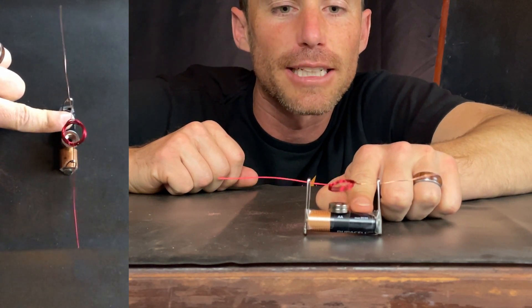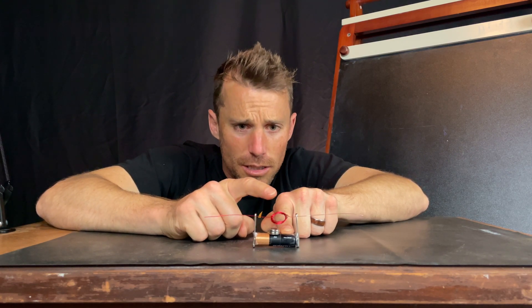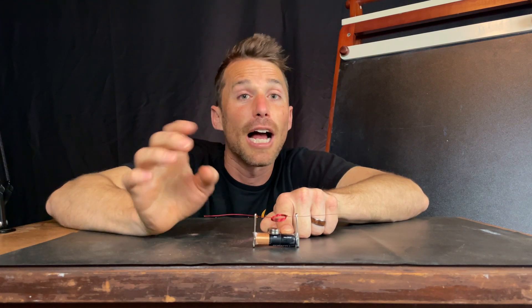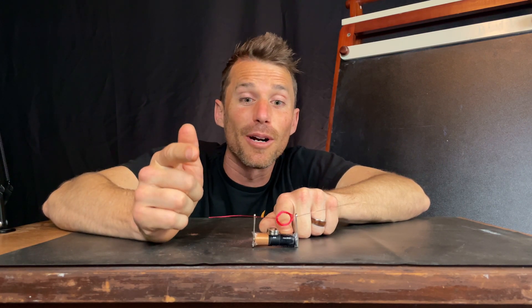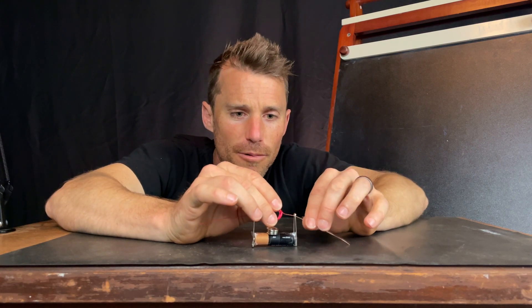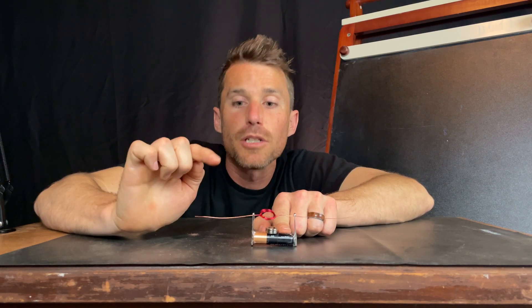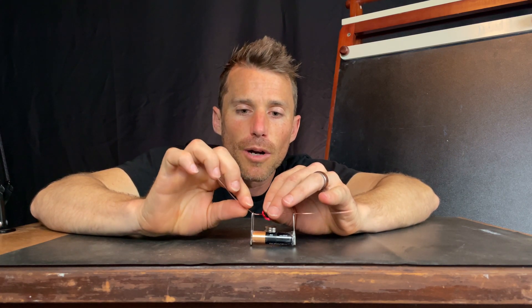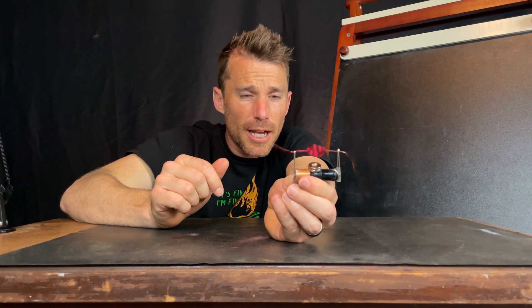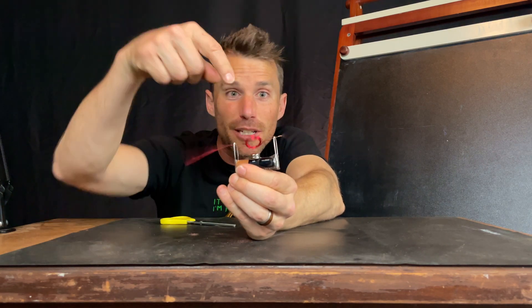I just think these are so cool. I made one of these when I was in elementary school, maybe second grade, and I lost to a fella in the science fair who did a rad project on toilet paper. All I did was make this little motor, which I think is cooler than toilet paper. Moral of the story is I didn't successfully make one of these until this year — they never really worked for me because I didn't do this sanding trick. It wants to just slide off to the side, so I'm gonna bend the wire above the magnet — that kind of holds it in the center. If you once get it working pretty good, you could put some little fan blades on there and make yourself a little DC motor fan.